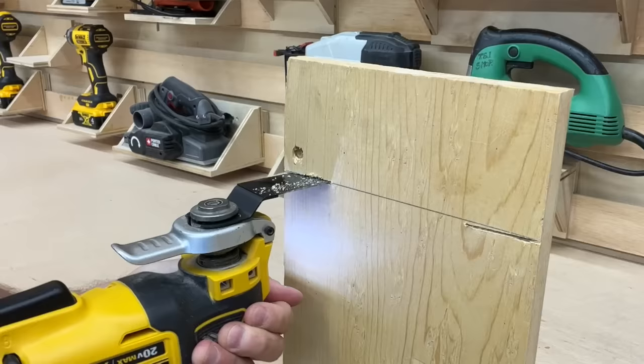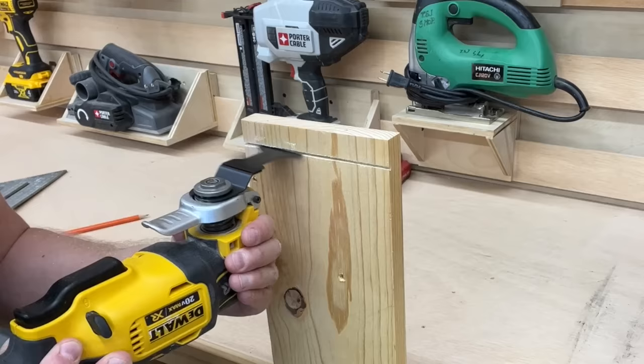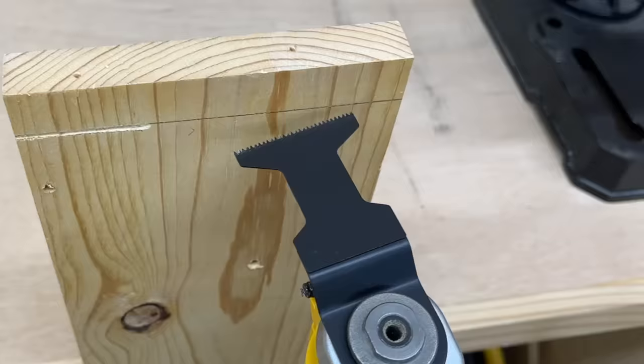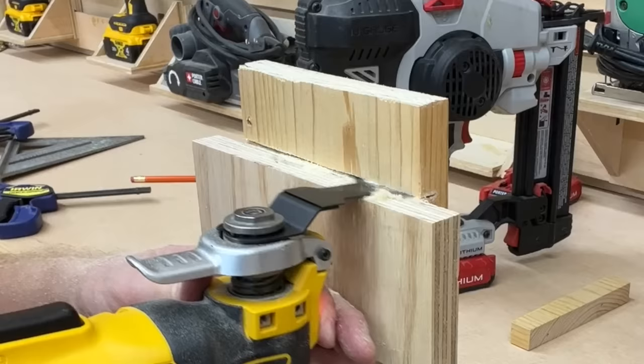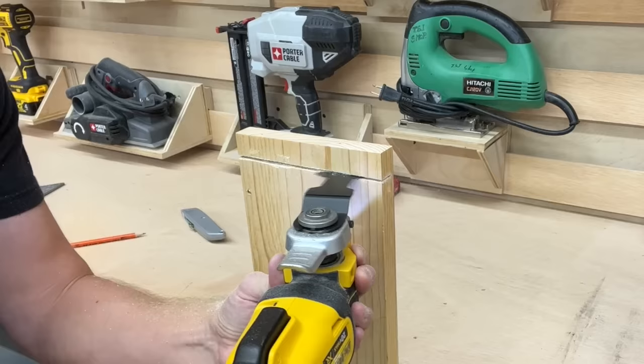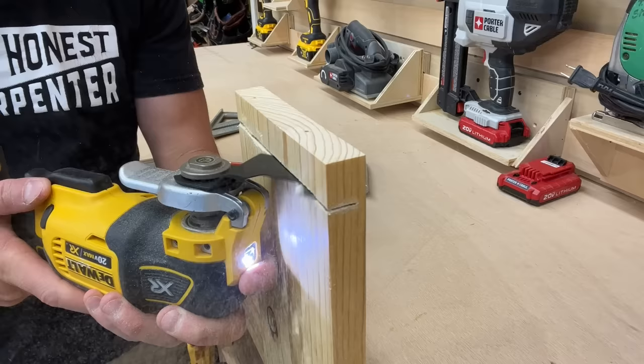Mistake number four is overdriving the cut. Even after you've scored your whole cut line, don't just plunge the blade in with full force — this will trap it in that localized part of the wood and probably cause it to bind up from pressure. Instead, sweep your cut line. Make light side-to-side passes all the way across your cut, taking about a sixteenth to an eighth of an inch depth on each pass. Lean the saw away from your cut direction ever so slightly so the frontal teeth engage the wood as they approach it. These shallow sweeps avoid binding, push sawdust out of the kerf to relieve friction and heat buildup, and eventually punch lightly through the back of the material.